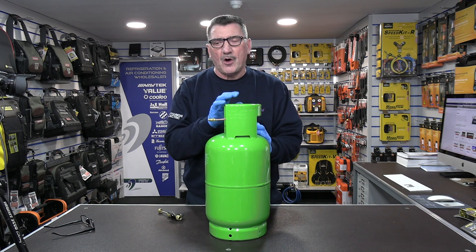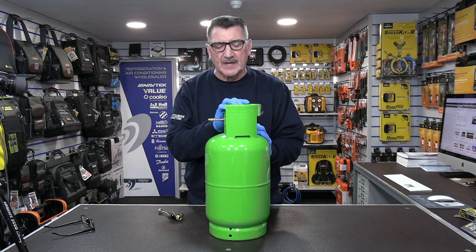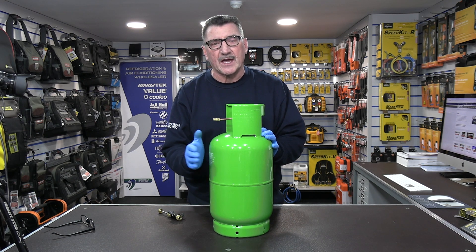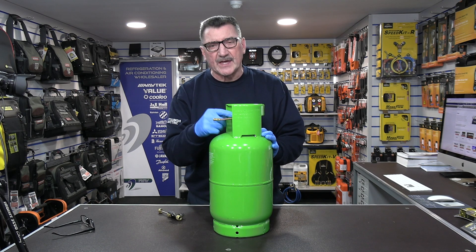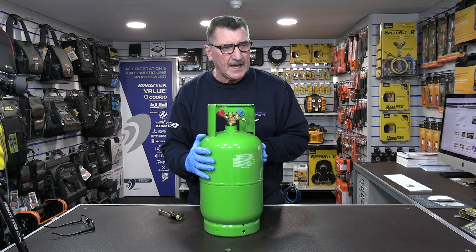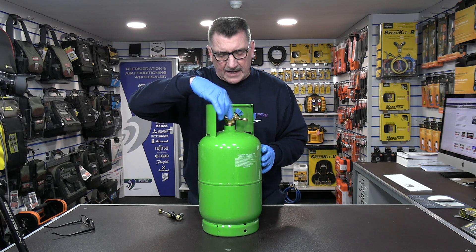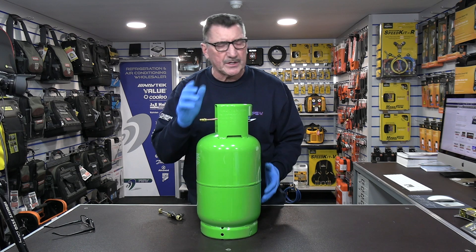What I always say to them is to test it first on a bottle of R410A, because it's got a decent amount of pressure — roughly 200 psi. For this test example I've filled my empty service cylinder with 200 psi of OFN. I've flared and screwed a quarter access stub on the cylinder. We've got roughly 200 psi coming out the liquid valve, and the stub is on the suction valve.